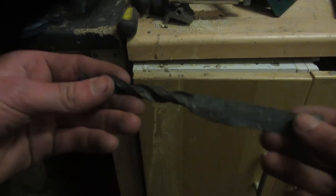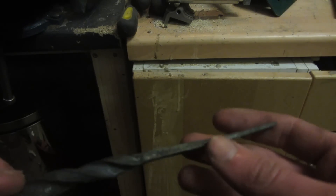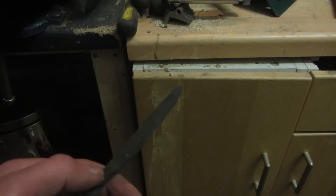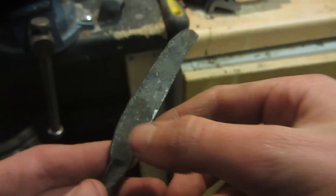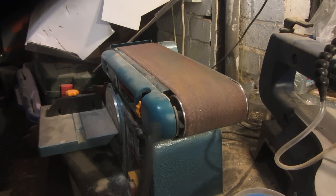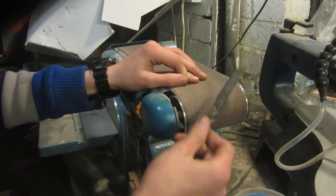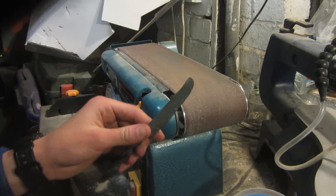After forging, I've half-forged the bevel — it's thicker on one side and looks a bit like a butter knife right now. I'm going to sketch on a design, then grind and file it using the belt sander and metal files. The plan is to flatten the blade and curve it up into a tip with a flat edge on the back. You could also use an angle grinder or bench grinder, or metal files if you have the time.